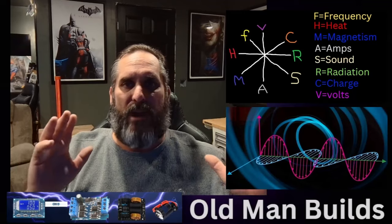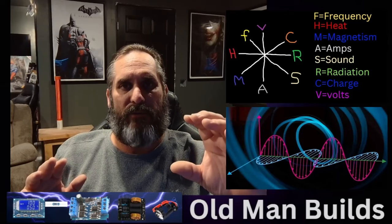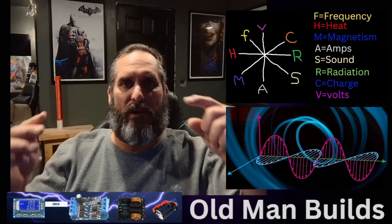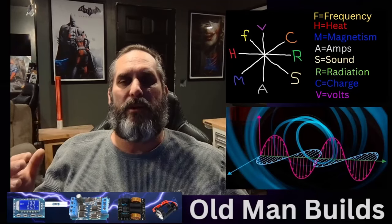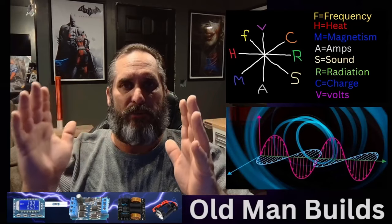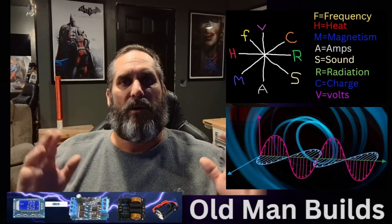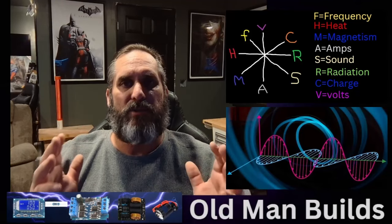Some are the action that you put in, some are the reaction you get. Standard circuit: we take a 24-volt power pack, run that into a ZVS driver, run that onto a flyback transformer — DC flyback transformer. We set up the ground wire and positive wire and get voltage across it. If you put in 12 volts and 3 amps, you get a predictable response. What you're not knowing is that you actually just put a frequency in based on your voltage and amps. Can you change that frequency? Most commonly people will tell you no, but the actual answer is yes.